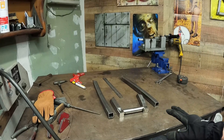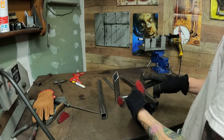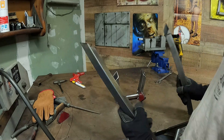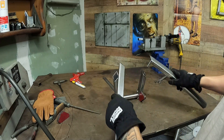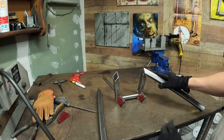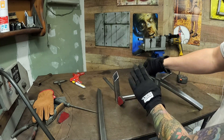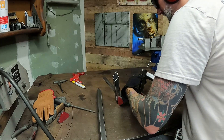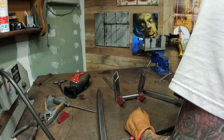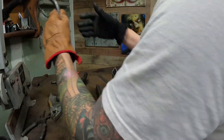So this is probably the least fun part about making the bars — just trying to get both sides the same. I'm going to lay mine here, magnet them down. What I like to do is I'll lay this one here — it's going to have to swoop up. If you did your cutting correctly, everything should line up pretty well. Normally what I will do to cheat it a little bit is I'll tack-weld the tips so that I have some movement to figure out where I need to be. That tends to help a little bit for those of us not so good at math. I'll just give this a little tack on each end before we go burning it in.